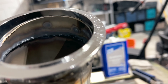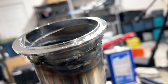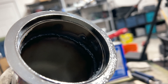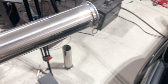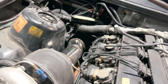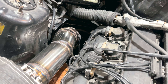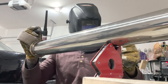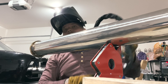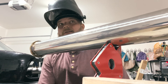I don't know what kind of stainless this is supposed to be, but it's doing some weird bubbling. What kind of trash is this? All of this is welded now — just need to weld one more v-band. And since I still don't have the exhaust pipes, I'm going to drill some holes and weld in my O2 sensor bungs. This one's all done; I'm going to bolt it back up to the car.